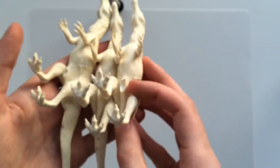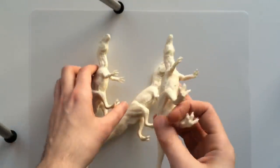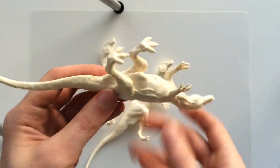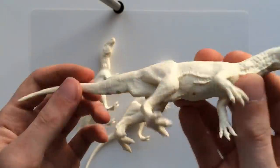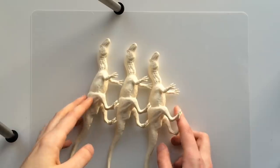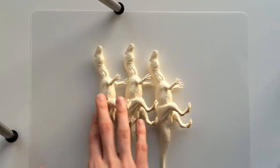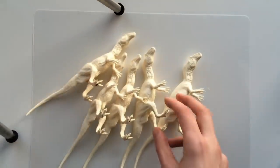This is the worst offender over here, and the best one came out when I tilted the mold to help the air go to where I did have vents. So this one would be pretty easy to fill. You've seen what we can get without the pressure caster — let's bring in the ones that were cast with a pressure pot.